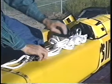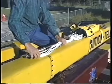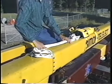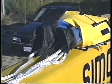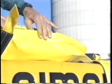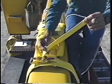The bucket rescue device consists of a set of three sheave blocks that provide a mechanical advantage of five to one. The blocks are sheaved with 110 feet of 3/8 inch double braid nylon rope. A loop is tied in the end of the fall line. The blocks and the fall line are packed into two inner bags and an outer weather resistant bag. The bags are made from 18 ounce vinyl. The whole system is held in place by two nylon straps.